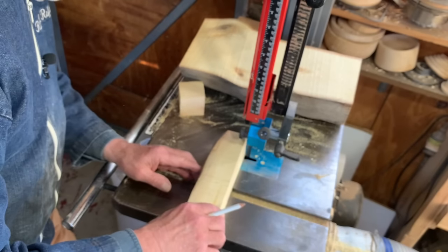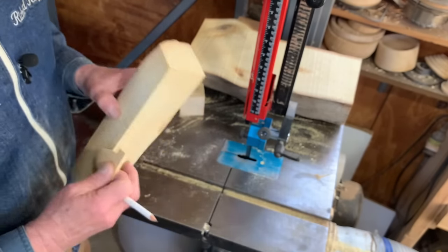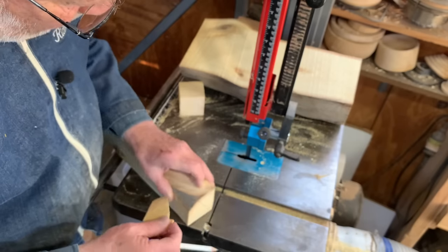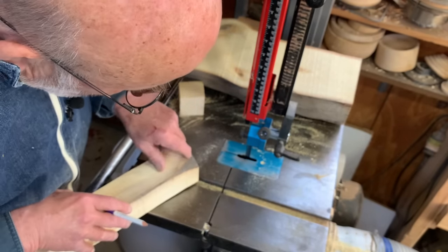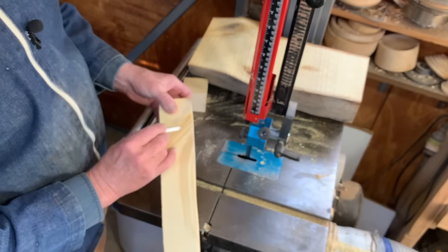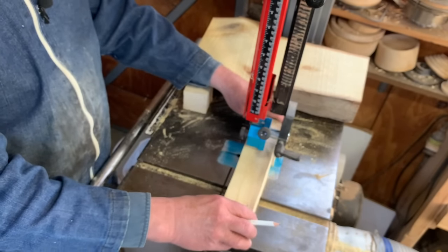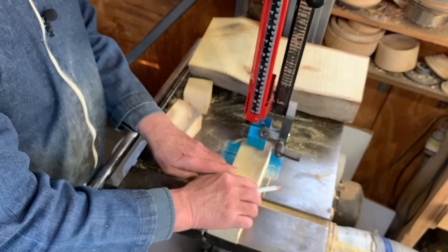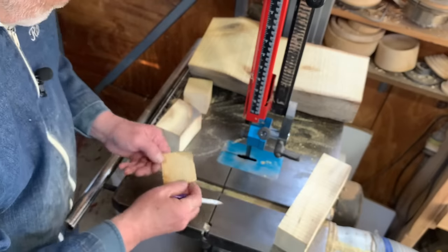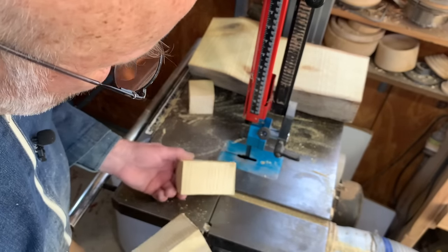That's end grain. It's likely to split anyway. I was a bit forceful. Right. So that's a split, which I can't see on the end of the log. But I think it's connected with a little split there. So I'll just take that off, and I'll think in terms of there's a split coming in from the knot here, and all the way down there. So that comes off. That's okay. That's a good blank. A blank like that can probably be made into an egg or something.